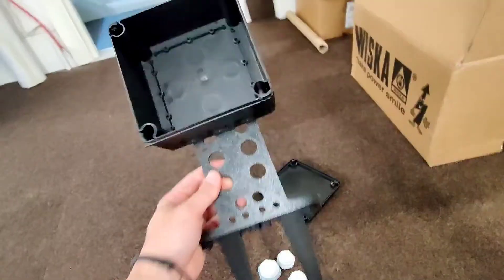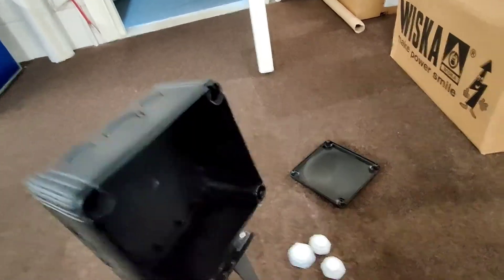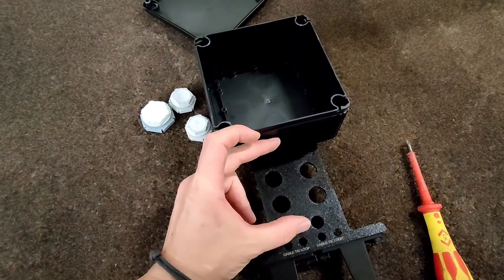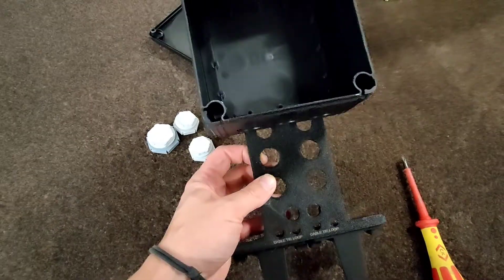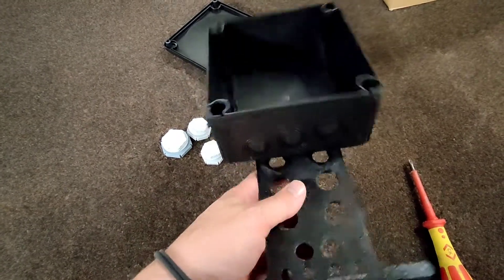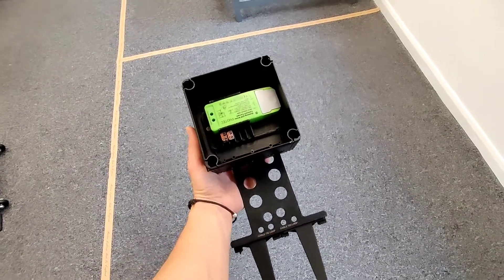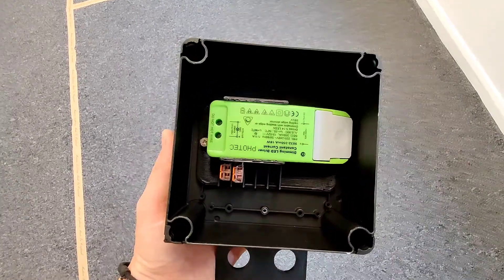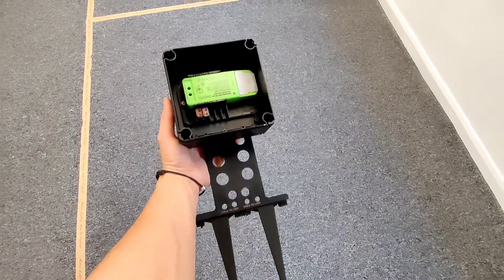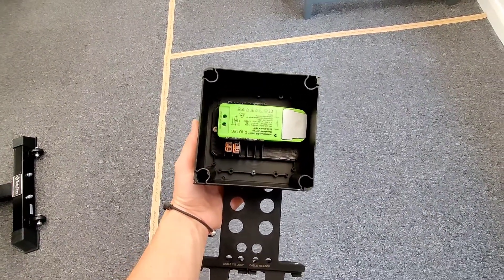There's your box attached. That would go in the ground and allow you to have your box nicely off the ground. The idea is it goes up to ground level, which gives you clearance for your SWAs etc., and they can be cable tied at the bottom if needed. Next is to get the driver plate in. For anyone keen-eyed, you'll notice the screw is probably the wrong one — we'll find the right screws.